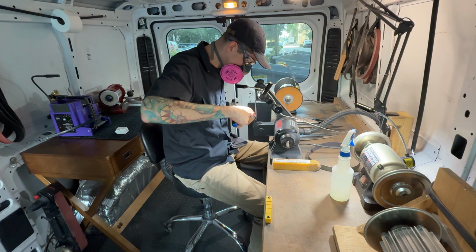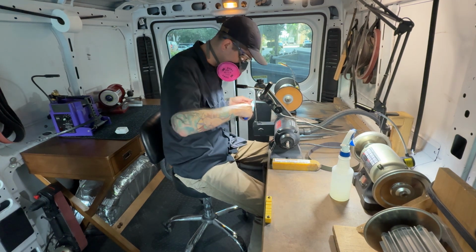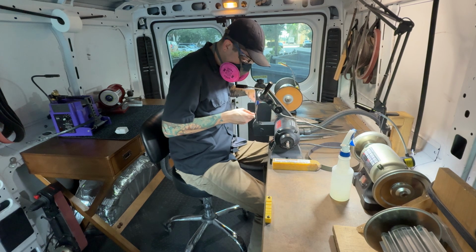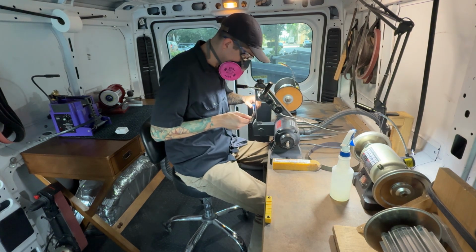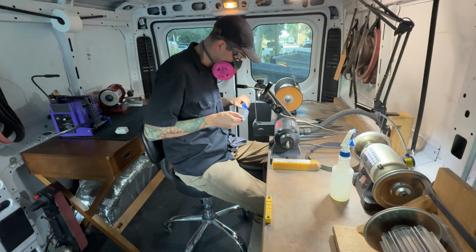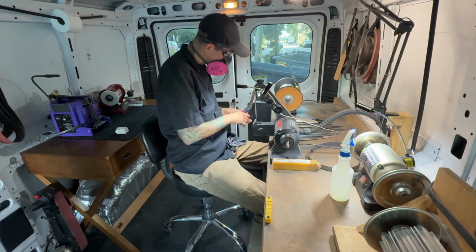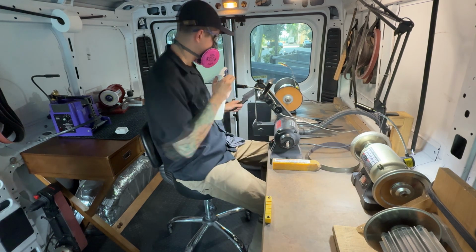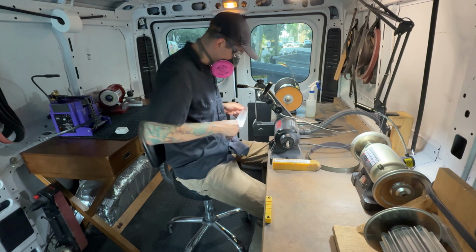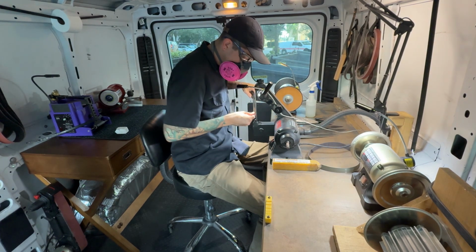And first knife here is a serrated bread knife. So first thing I'm doing is sharpening the straight part at the tip and also at the heel of the knife. Then I'm going to do a very low angle pass, almost like a thinning grind on the flat side of the knife, just to straighten everything out. This is a knife that gets sharpened very often, so this is how I keep it performing its best all the time. And then I'm just going to put it to the side because I'm going to do the actual grinding of the serrations later after I'm done with all the straight-edged knives.